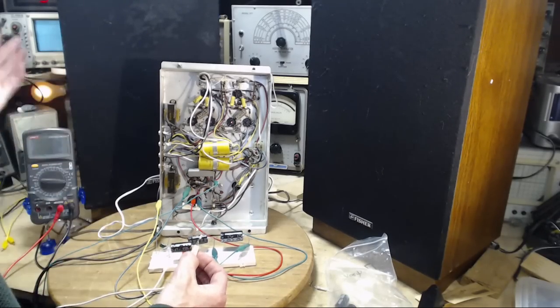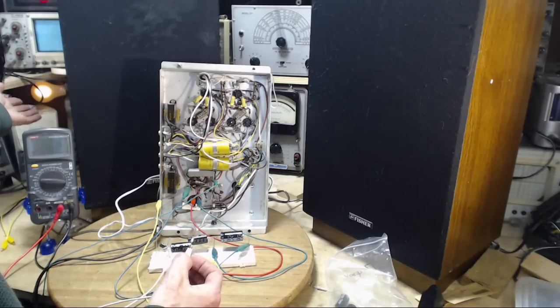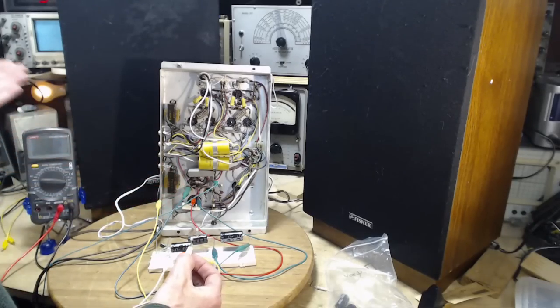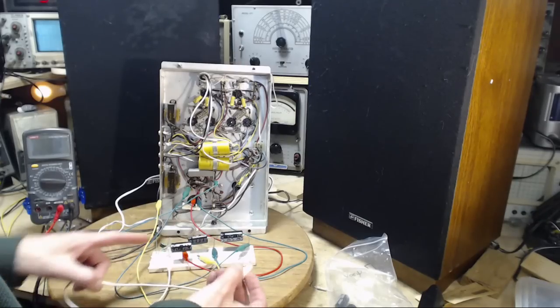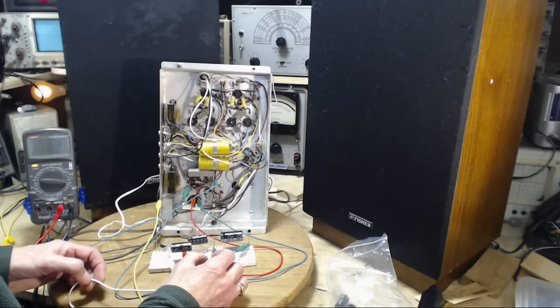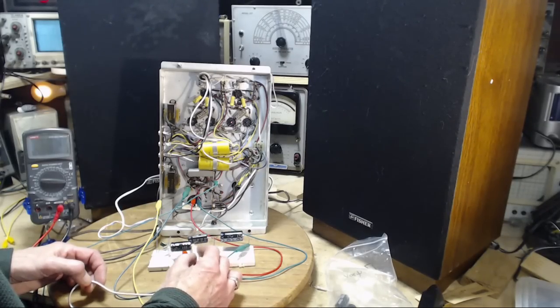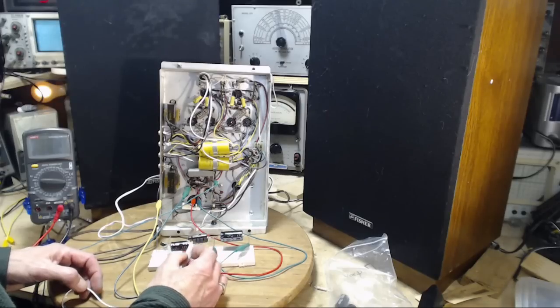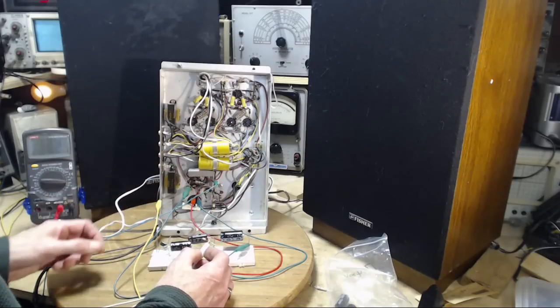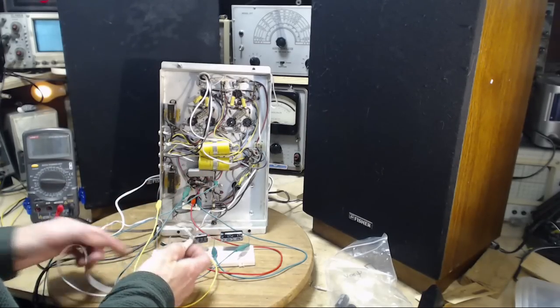Well, out of the corner of my eye, I could see the light change over here, and it seemed to me it got less bright. Additional capacitance, less bright. Boy, that didn't add up. Okay, let me discharge this. We'll try it again. I'll do it through the resistor. I'm trying to avoid what I warned about, taking an empty capacitor and just sticking it onto the power supply. A sudden charging current from the full power supply voltage could overload the diodes that I just put in.